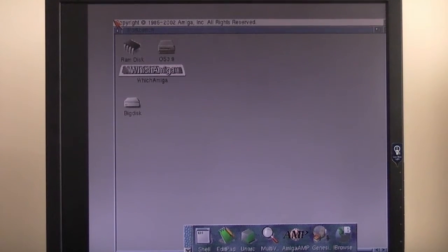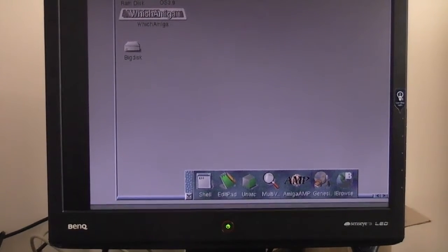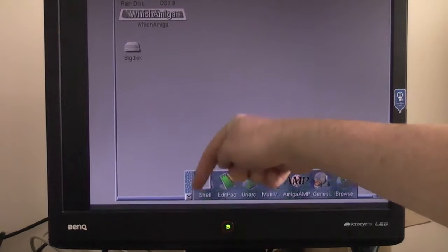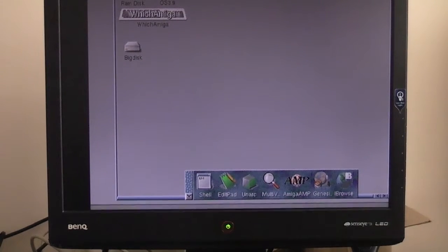So I am not sure whether it might actually be slightly off the bottom of the screen, but immediately you can see one issue that seems to happen to me quite often with this scandoubler, which is right at the bottom of the screen down here. There are a few scan rows off the bottom of the Amiga screen that seem to be filled with junk data and flicker and flash, whilst the rest of the picture actually is looking reasonably good. So that's a little bit of a distraction, slightly irritating that. But what else can we see?